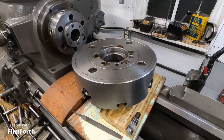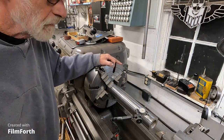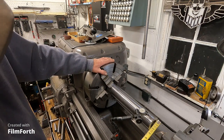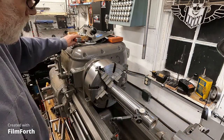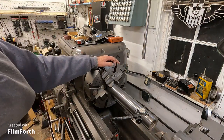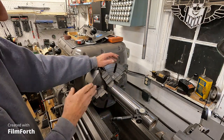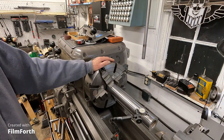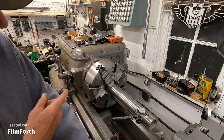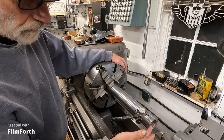I'm going to get that back on and do some other checks. Now this is what I was looking for — I got this piece of thick-wall tubing, two and a half inches, with one foot sticking out. I got it running within a half thousandth here and within a thousandth out at the end. Using the stones and a file on that back mount, I got the face of the chuck to run a thousandth and a half out, making it possible to get this running true out at the end.